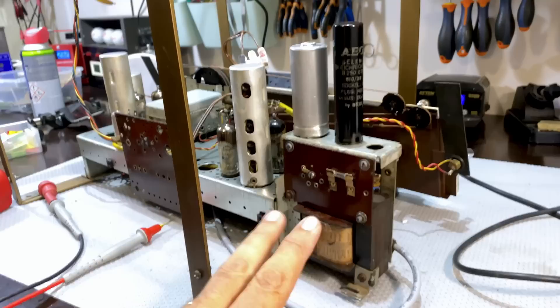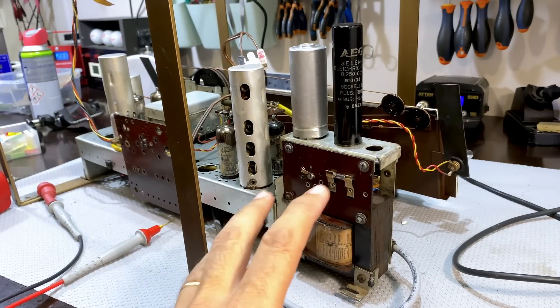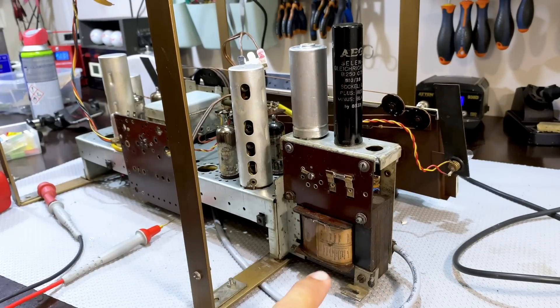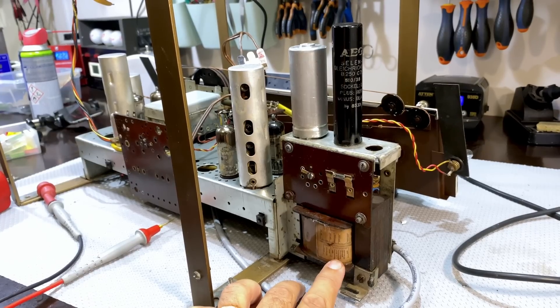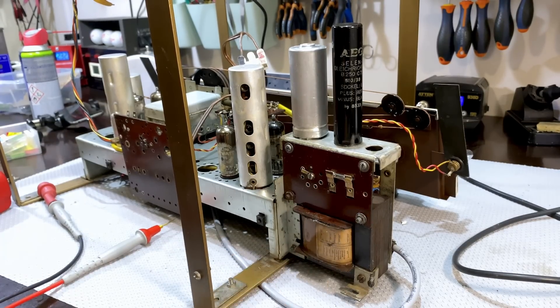It's in the primary circuit. When I take the power socket and measure across it, I'm measuring 47 ohms when set to 240 volts. That's not unusual — I checked with another Grundig here that's 46 ohms. So that doesn't seem to be the problem. There's something strange probably happening in this wiring back here. So what I'm going to have to do is dismantle this whole thing. If necessary, I can probably find a donor transformer — this is not too difficult to find, or from an old radio not going to be used.